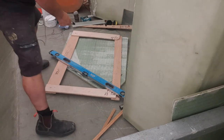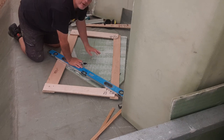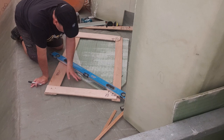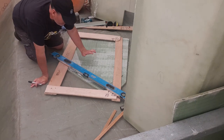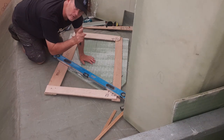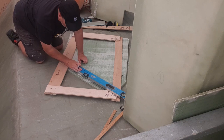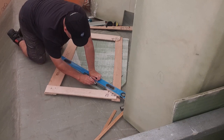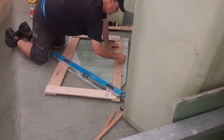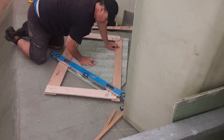Okay, so this was the offcut off the large sheet that I made. Short of me making up another 12 or 20 mil sheet of foam and four layers on each side, this offcut is almost going to suffice, except for a little corner, but the little corner will allow me to get pipe work and everything up in it. So I'm not concerned about that, but I do have to cut it off along this line here. And then the outside is going to be along this line here. So nothing's wasted here on the mould.